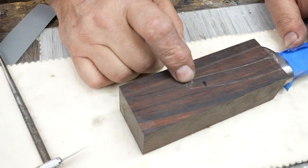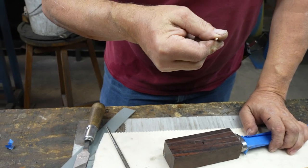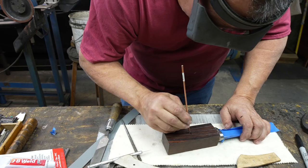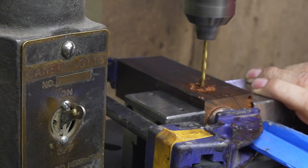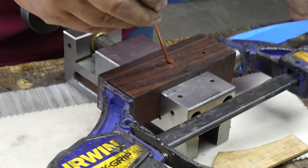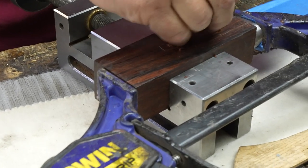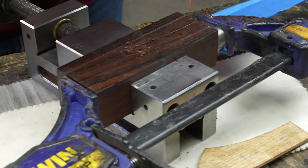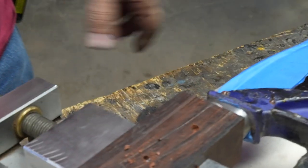Now the pin I'm going to be putting in is a copper mosaic pin. You can't really see the detail on the end of it yet, but it's an eighth inch diameter. So I need to poke a hole an eighth inch here and an eighth inch here. It fits. Goes right through. Excellent. And actually it's snug. The very top is blown out a little bit, but we're going to be cutting off enough metal that it's going to work out fine.